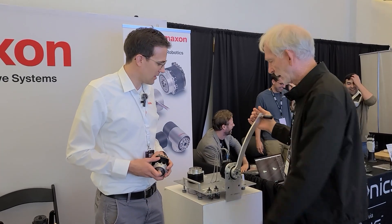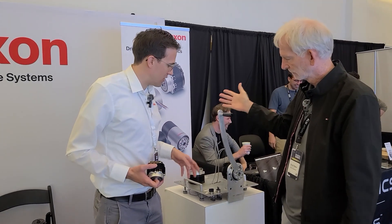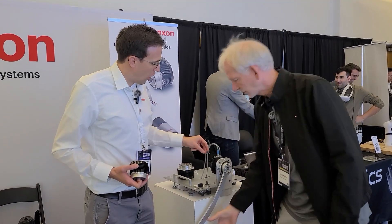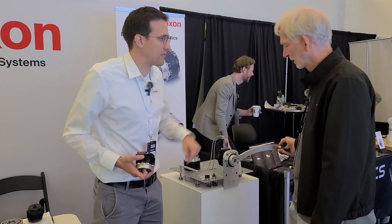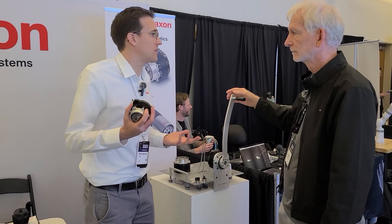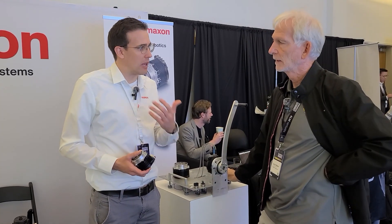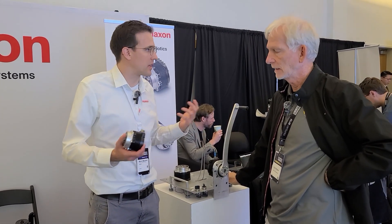Is something going to happen if I do this? Yeah, I can turn the friction compensation off and it stops doing that. We need to compensate the gear losses and the friction of the output seal, because these things are IP67 rated. IP67 — that's very good. That's also something you need for a well-scalable robot that is outdoors and exposed to the elements.